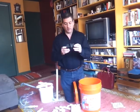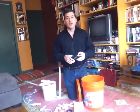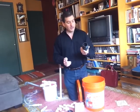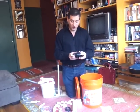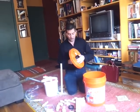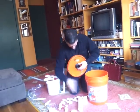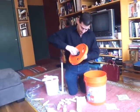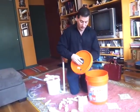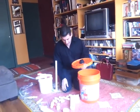For a two-inch tank adapter or bulkhead fitting, it's pretty hard to find in the US — Home Depot doesn't carry them, and Ace Hardware sometimes does. We get ours from Magdi Zahran in Egypt, where they're made in various sizes and are very inexpensive. The bulkhead fitting slips through the hole with two O-rings, one on the bottom and one on the top. I put it into the lid, place the locking nut down, and hand-tighten — no wrenches are necessary, even on a large family-scale digester, because you're just clamping down the O-ring.